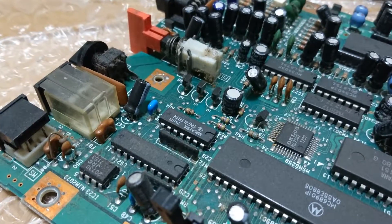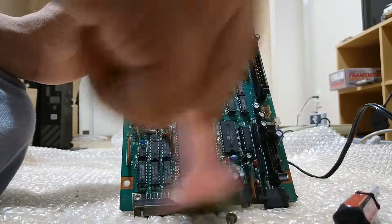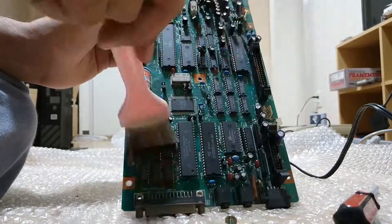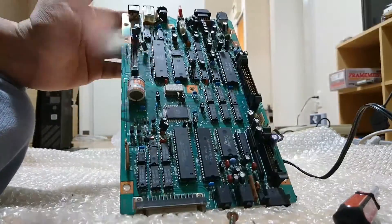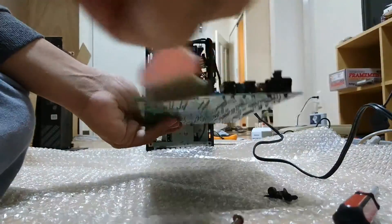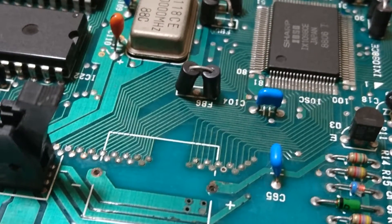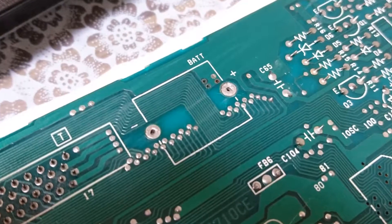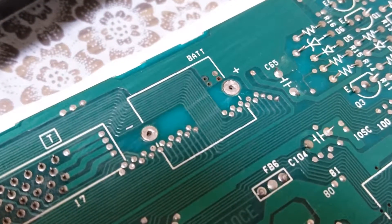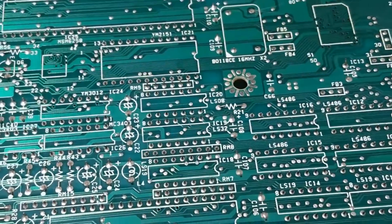So I took out my faithful dust brush and went crazy with it. I made sure to go through every nook and cranny on the PCB surface. The brush is really soft and thus I was not hesitant to apply force. Once it was relatively cleaner than before, I desoldered the battery and gave it a bath with 100% isopropyl alcohol, making sure to remove as much crud and corrosion as I could using a soft old toothbrush.